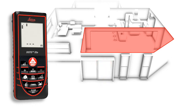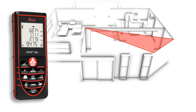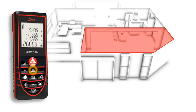You are prepared for all measuring situations. The automatic end piece helps you to avoid expensive measuring errors. Rooms are not always rectangular and simple to measure. The triangulation function can also help you quickly capture the area of a polygonal room. You divide the room into imaginary triangles, then use three measurements to determine the areas of each of the triangles, which can be merged automatically. Finally, all you have to do is read off the result.